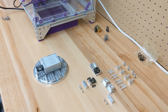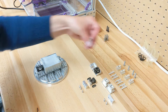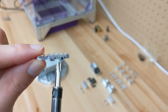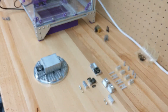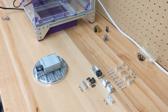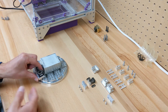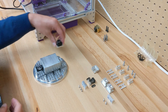The stock's not going anywhere. As with the base plate and fixture plate, I have redesigned these components a little. The main change is that the teeth on the racks currently give about 4 millimeters of movement each increment — I've changed that to 2.5 millimeters, so the increments are much smaller, giving you much greater accuracy for positioning parts. You may also want to put another clamp wherever you want, as long as it's above a groove — you can put three along there, one in the side, or two in the side. Configure it however you want.